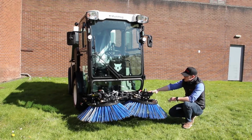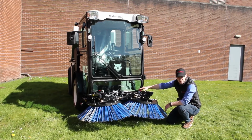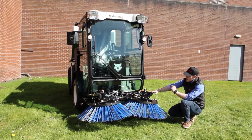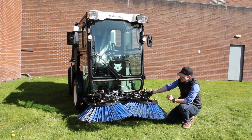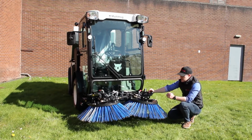Taking those brush arms off, you will see that you have double acting quick release couplings that control the brush arms. So you would pull them out, and then your other attachment functions would plug into them. You also have couplings for your high flow hydraulics there, where you have up to 100 liters per minute or 26 GPM high flow hydraulics from there.